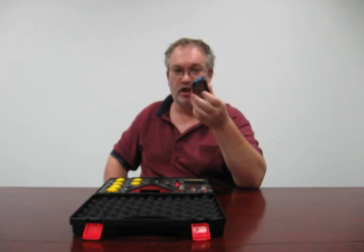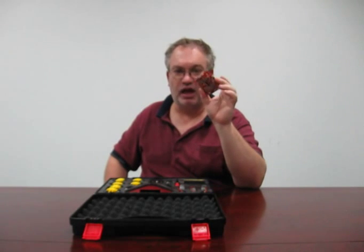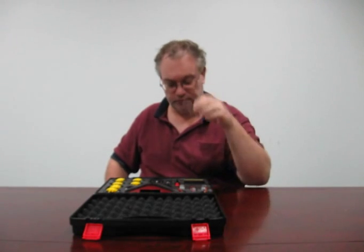This makes it very easy. It is pre-programmed with demonstration software, but when you later plug it into an Arduino, it becomes an I2C motor controller. Because it's I2C, it only uses two pins. That leaves all the other pins free for sensors, shields, etc.